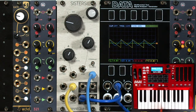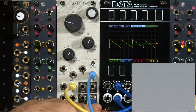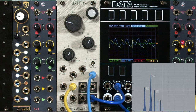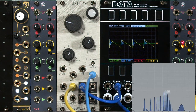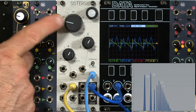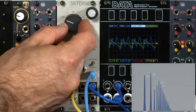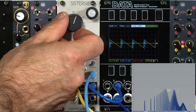That's a nice low sound there. One bandpass filter — the center, which is the middle of the three bandpasses. And the high — the highest of the three bandpass filters — you hear the very vocal-like quality there. Then mix all together. The center frequency of those is controlled by the central cutoff knob, and you can see the three humps on the frequency analyzer display.